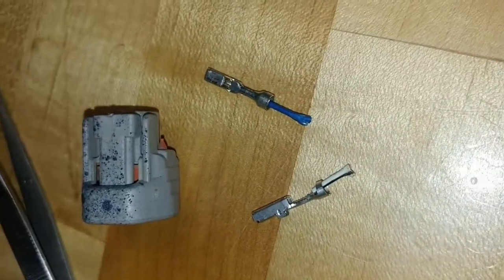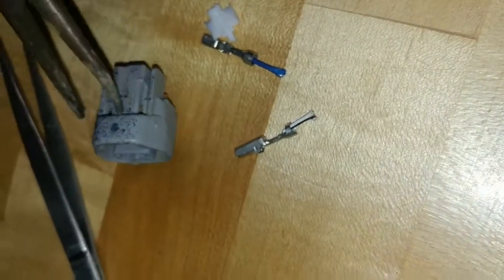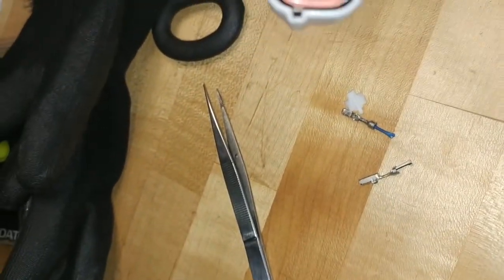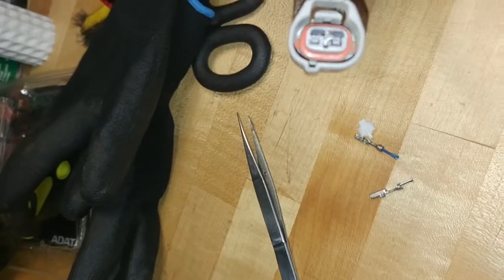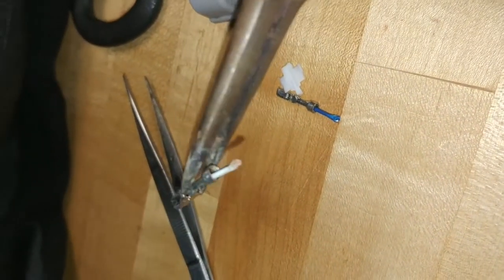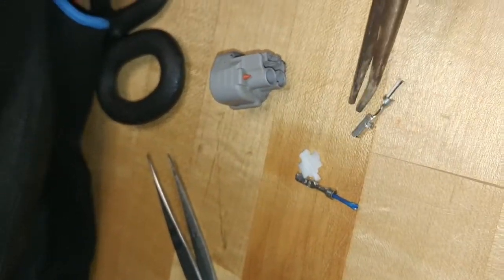Let me say, this is not for the faint of heart. This connector here, it's in three parts. You can see the little plastic tabs that lock the wire in there and you have to push those to the right on the screen, away from the wire. Then you can yank them out. That's it. I could either fix these with more wire or put new ones in. I think I'm just gonna fix them, and then I should be good.